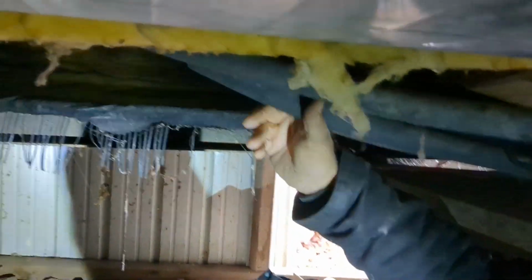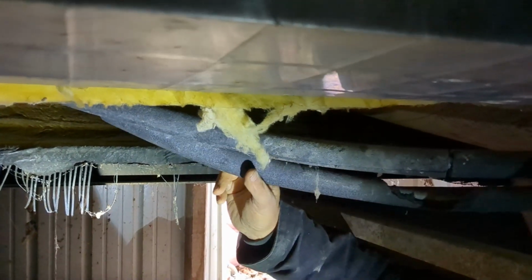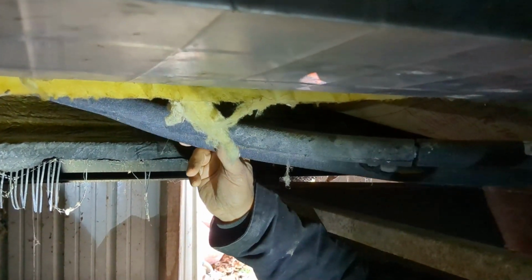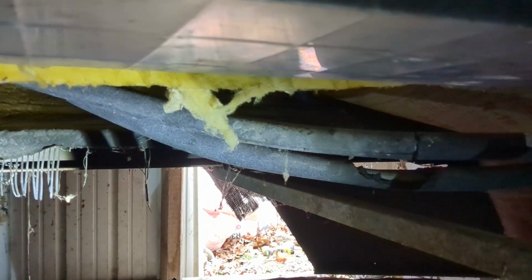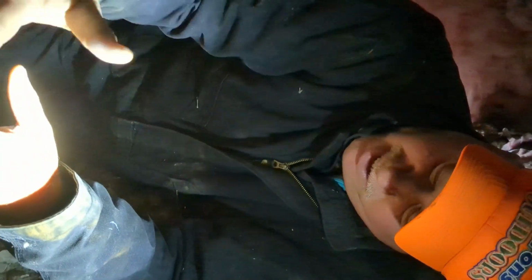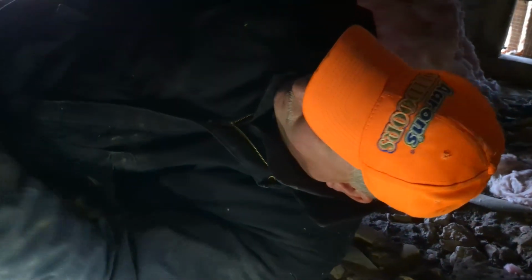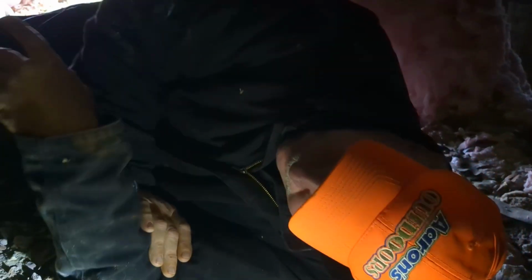Also, we need heat radiating from this aluminum ductwork so that it stays inside this lowered area and it protects this kind of thing. Your supply lines for your water, this little bit of insulation is not going to protect it from a major freeze. It'll help, but it won't keep it. But guess what? Being it's in the same area, this radiates down and keeps this from freezing as easy, nowhere near as easy if we drop this and have just a little tiny bit. It's not much, it's like 1.5 inches of insulation. It's not even close to R19, so it's real low insulation.